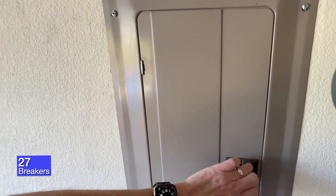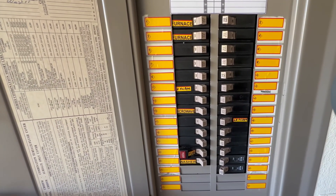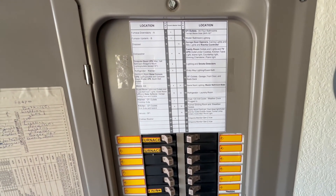I just finished showing you how to parallel the generator and also how to put an hour meter in the generator. Now I'm going to show you real quick how I power the house. I have a subpanel in my garage which is all 120 volts — of course it has two legs — about 20 circuits. I rerouted the 70 amp breaker on the outside of the house into a transfer switch. It works like those Reliance transfer switches with six or eight circuits, where you flip it to off and then to line or to generator. This just does the whole house.